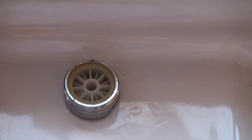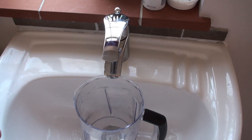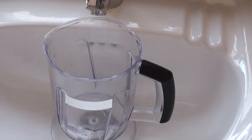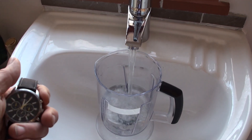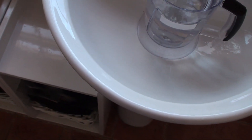I'm going to put these in — these aren't Grohe units, they're from the old taps. I'm a bit disappointed Grohe didn't supply them. Middle position — we've got a one-litre mark on the jug, the underside of that line is one litre, so that should give a reasonably accurate measurement. That was 10 seconds — 10 seconds per litre. Sounds like a Veyron going down the runway.